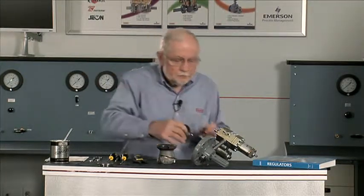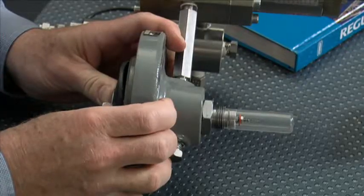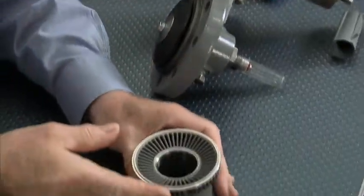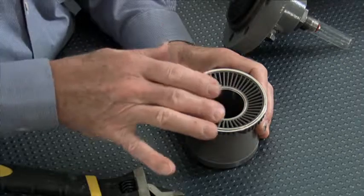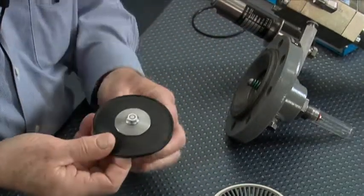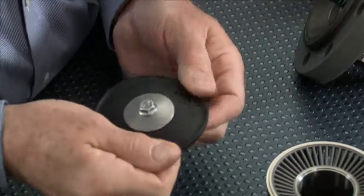The plug assembly itself goes up into a stainless guide bushing in the bonnet, so you always come back to that same position. If we take this cover off, we can see that this unit has a travel indicator in it, and in operation we can tell if the unit is shut off, open a little bit, or wide open. We're going to inspect the cage — it has a knife edge seat which is very important for shutoff, so we want to make sure we don't have any nicks. It's made out of hardened stainless steel, so normally we wouldn't expect anything wrong. We're going to pull our plug assembly out and inspect this diaphragm, looking for cuts or small holes starting to form. If you pull the rubber a little bit, if there's anything in there you can usually see that.